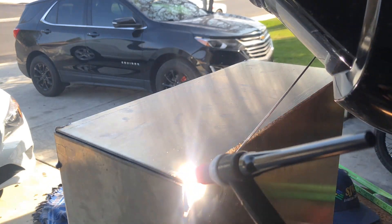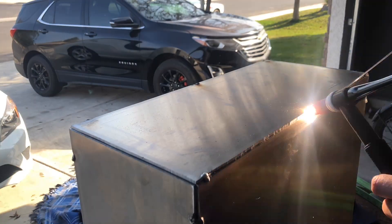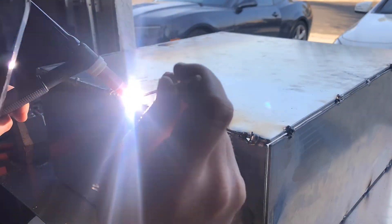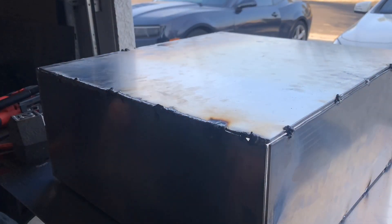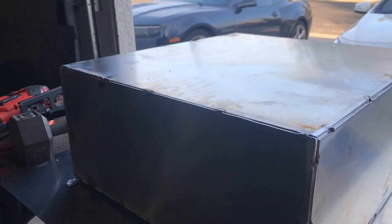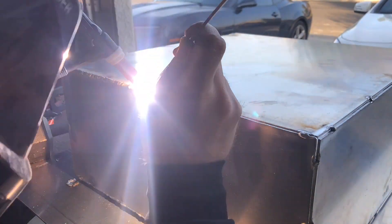I did have to actually disassemble it a couple of times from the tacked position to make sure everything fit well, so it was a bit of a learning process. The most difficult part was getting the settings dialed in. I moved from being completely terrible at TIG welding to almost proficient — to the point where I can make a bead that penetrates well and is not terribly ugly. A lot of what I did is not shown on camera. This part of the box I had to disassemble because I did not tack it frequently enough, and the extra thermal conductivity of aluminum allowed heat to travel more, causing significant warping.